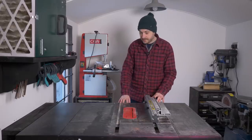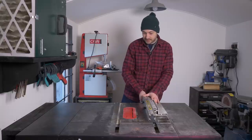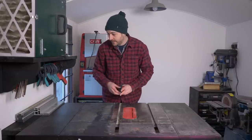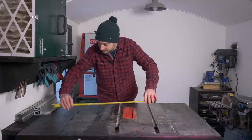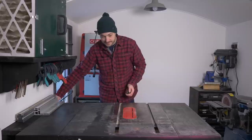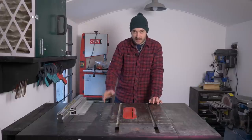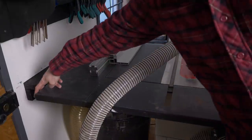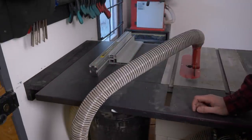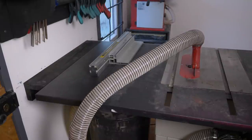That's it all together and I'm pretty pleased. It all needs a bit of a clean up — I've got some pink paint on there which was rather stupid of me. The fence now travels from one side all the way to the right, and it's got the knobs on the back for the auxiliary fence. I've got about 74 centimetres of rip capacity which is fantastic — I can't see why I'd ever need more than that. There is one problem I didn't foresee: I left a gap for the dust hose for the crown guard but it's not long enough, so it has to hang over the back. When I've got some money I'll buy a longer hose.